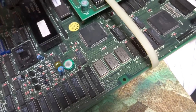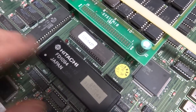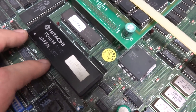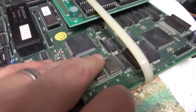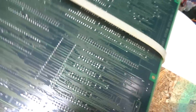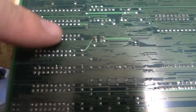The super capacitor aside, these are the notorious Hitachi chips which have a battery on the inside — it's a coin cell battery, and once they die they take the chip with it. Luckily, thanks to the Sega Resurrection Society, you can get these boards repaired. You can also see there's another jumper wire here going from that super capacitor.